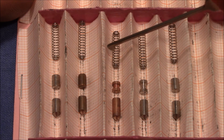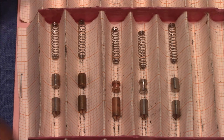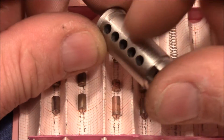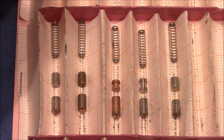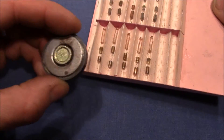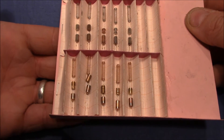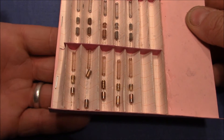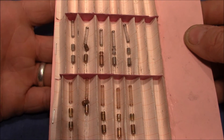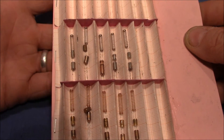Could be that the coating is off on that pin — I don't know. The springs look like they are made from steel. And the plug — again, everything is smooth, nothing flattened, everything looks very well made. I can show you something interesting with my magnet. I put the magnet in the back and you can see that the pins of stack number 2 are moving, but no other pins are doing that. The same here — the pins of stack number 2 are moving, and the springs of course, because they are made from steel.